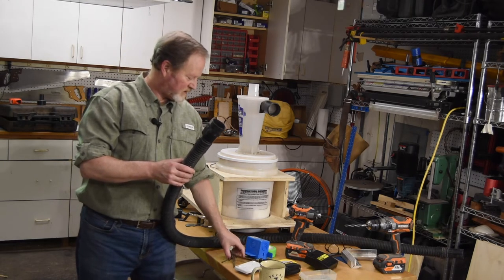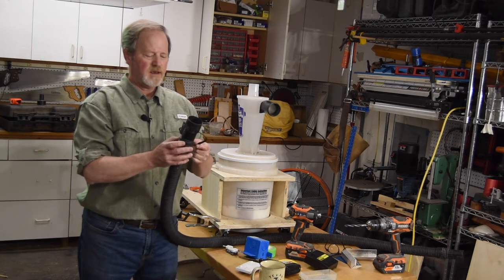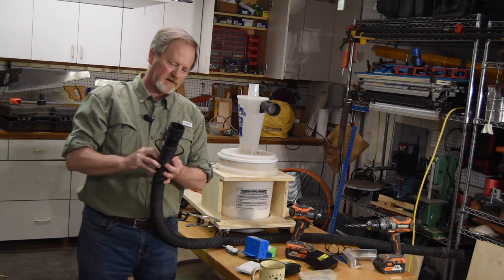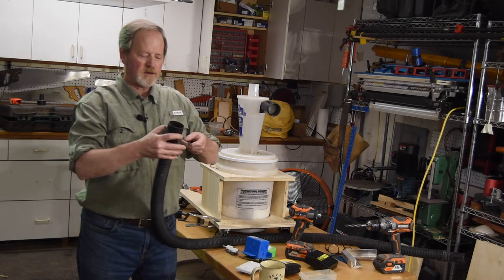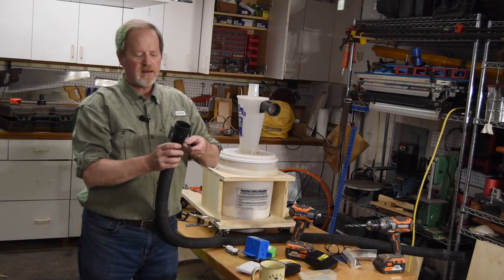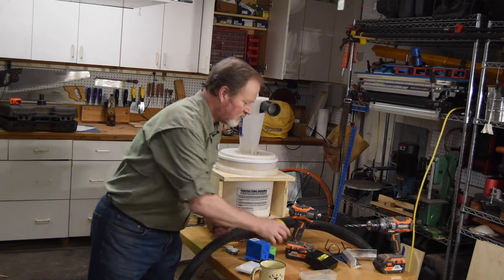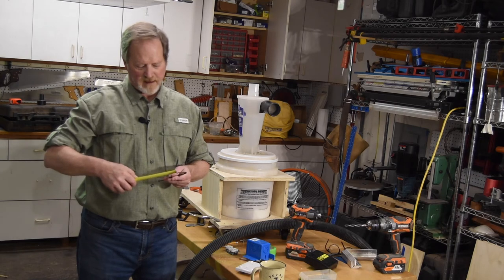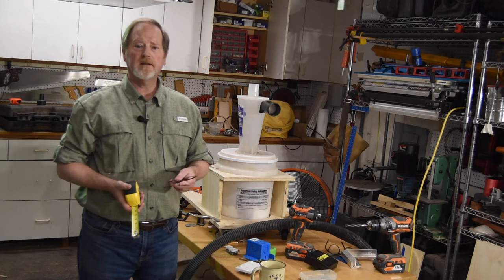And it's hard to do that with a tape measure, but if you've done any turning, some of these are really handy items. And you can take these, give it a little bit of a turn. Boy, this one needs a little oil. And once it just starts to go through like that, just barely, then you know you've got your dimension. And from here, very easy to figure out exactly how big that hole is. And that's 1 7/8. Now, I've just got to find a bit that's 1 7/8.